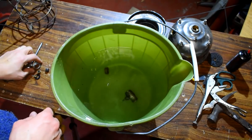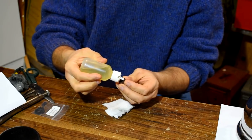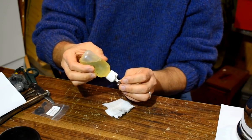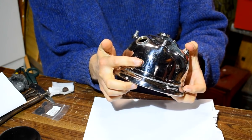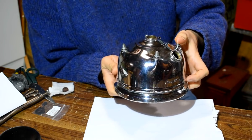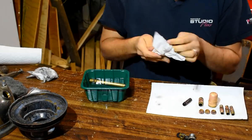All of the steel parts go into this bucket and the brass into the little tub. While the citric acid does its work, I'm going to put some more Neats foot oil on the pump leather — these ship dry and will absorb a bunch of oil before they seal well. I'm really pleased with how the fount turned out — this is after a couple hours of polishing with Mother's Mag Wheel Polish on a cloth. The plating is thin in a few places but looks pretty good. After soaking, I scrubbed all the pieces with steel wool, leaving them nice and clean but not over polished.